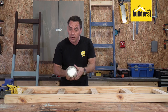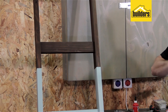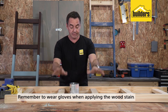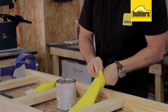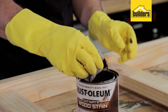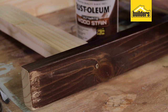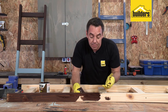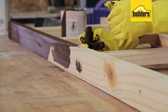I'm now going to apply some wood stain. I'm going to go for this dark look on the underside, and then I'm going to cover it up again with the chalk paint. When you are using wood stain, it is very good at staining timber and your fingers, so make use of these gloves just to keep that stain off your fingers. With this stain, you can actually just apply it using a rag and just rub it in. I've actually left my screw holes open — I want that rough, rustic look, so I think it'll actually add character to the ladder. If you want, you can countersink those holes as well as fill them up with some wood filler and sand them down smooth so they won't be visible.